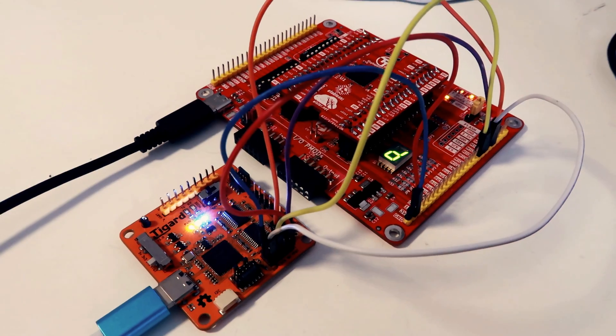This means circuits and PCBs, so I'll cover all the bits you need to get a bare FPGA chip running in a circuit. But to make it really usable, I also want to simplify updating it. FPGAs take in a bitstream that configures their logic and tells them how to do their job. Usually that config sits in some persistent memory, like serial flash, so the FPGA will always know how to behave after powerup, and setting or updating the instructions means somehow getting the bitstream into the flash. The obvious way to do this is to program the flash — use some sort of programmer, connect it to the SPI pins, and push it. That means software and hardware, and it is a big hassle really.